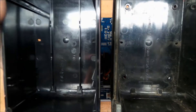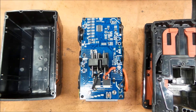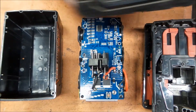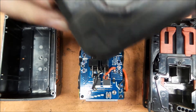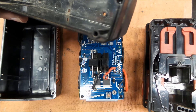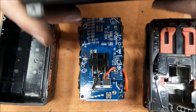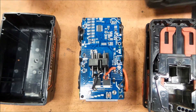The casement is also very similar, with the exception that the M28 battery has this metal piece — I'm assuming it's molded into the plastic — and that is where the cover screws into on that metal piece, which is actually pretty strong. The M28 battery had eight screws in it as opposed to this having four, so it would take a little bit more of a hit. It's also got rubber on it to try and diffuse impact.